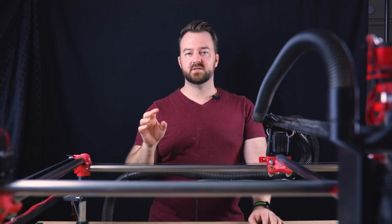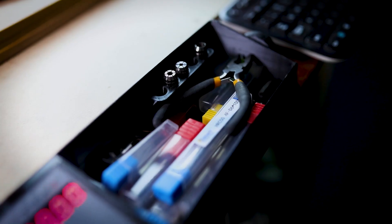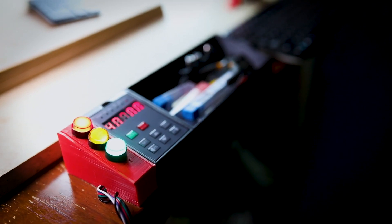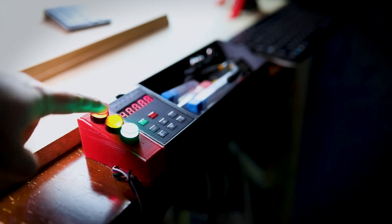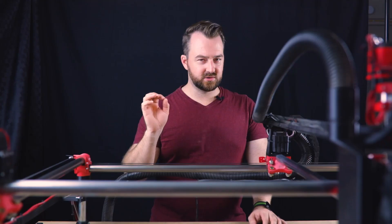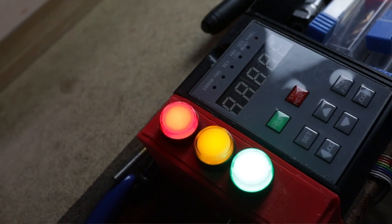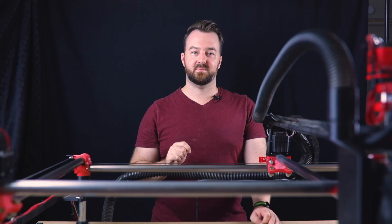I also realized that on my GRBL settings for my Arduino, I had three outputs. Those allowed me to stop the machine and pause the machine, so at any time I was running anything I was able to pause it in case I needed to fix something slightly. The last button was a start or continue button. I used the RST, the feed hold, and the cycle start outputs on the Arduino, and I also used the 5V output to light up the LEDs on the buttons.